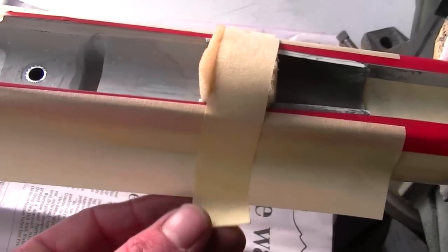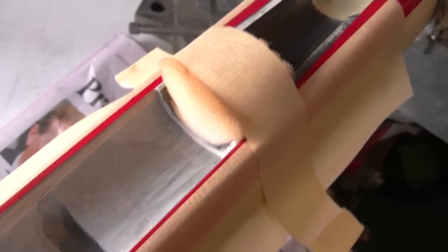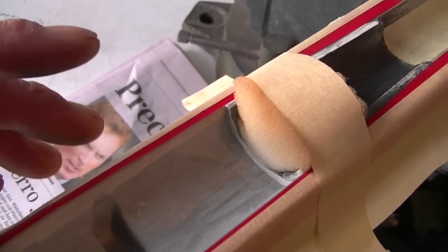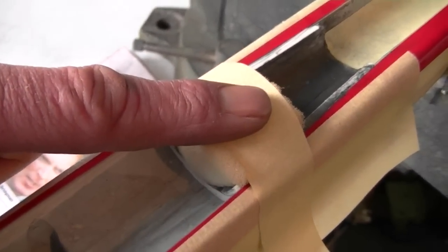I've fitted skirts for the compound to leach out of. These will be ripped off as soon as we've put the action down into the job. We'll give it a basic clean-up, then pull the skirts and give it a final clean-up. I've put a secondary dam up front with pull tabs on my masking tape, so I can fill up to this height, let the compound settle down, and then when we're ready to put the action down, we'll lower the action until the barrel's touching, pull that tab, and then slowly put the action down the rest of the way so we don't lose any compound.